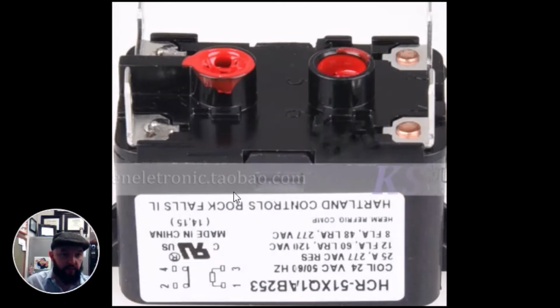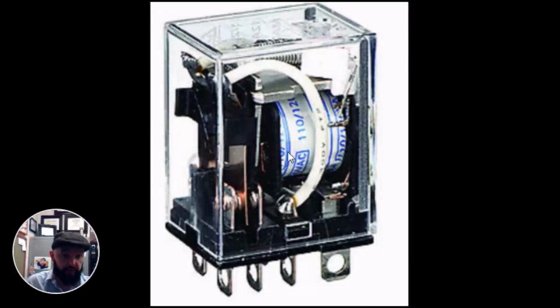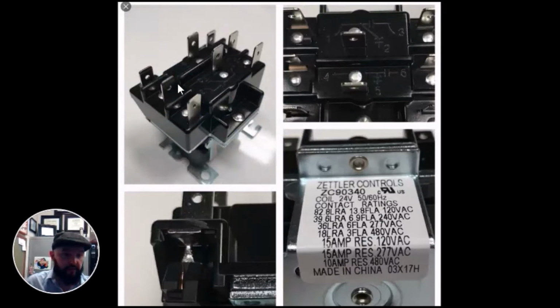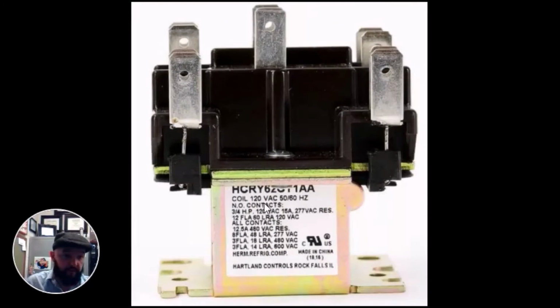They can have a coil on one side and anywhere from 2 to 6, sometimes rarely 8 terminals for you to hook up a source of power and switch between legs of power or speed, for example, on a blower motor. And working very similarly are the commonly referred to ice cube relays, which are general purpose relays. So let's start by looking at the most common, a 340 relay, and their brothers, which are the 341